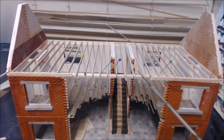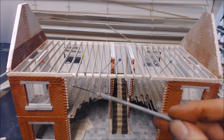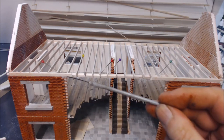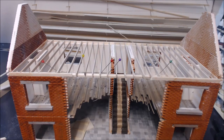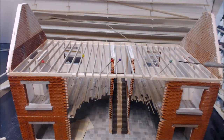All the floor joists are in now. I had to cut the front out just here because it started bowing out and wouldn't behave, so I chopped that out and put a timber underneath the joists from side to side. I did one end then the other — that gave me somewhere to lay the floor joists on and keep them all in position. The next little job is to put all the noggins in — two rows on that side and one on the other side — and get the chimneys built up so I can get the top timber in to create the roof.